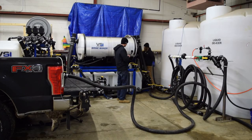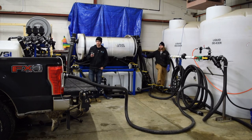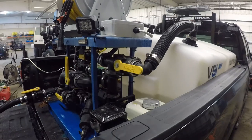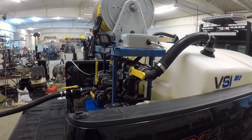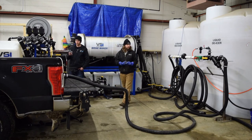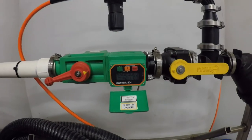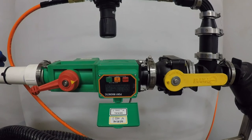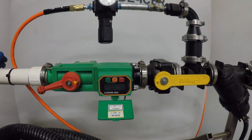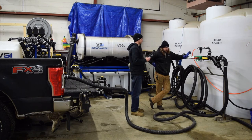It tells us how many gallons are already in the sprayer. So we're at about 60 gallons now — almost halfway there. And you'll see that this system is going to shut itself off as soon as we hit that 135. Then we know to shut the pump off, we're going to switch to our additive, reset it, pump that in, and we'll be good to go.